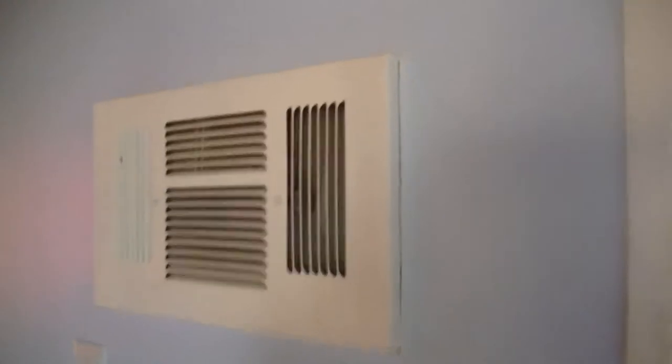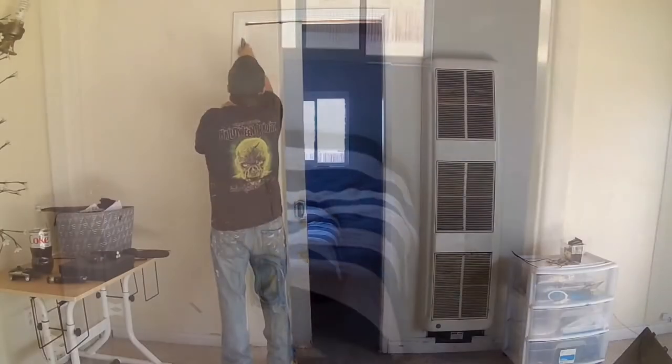It's an old door, so I'm thinking it's probably on a J-roller, and it should just lift out. Then I'll be able to put some doorstop in the middle of this, and this is where it's going to open from. The room is kind of small, and normally you would want the door to open in to a room. However, it would block a heater if the door was open, and there's not enough room for a 32-inch door to swing. So it's going to swing outward, and we don't have an issue of security since it's just a bedroom. So removing it is our first job.